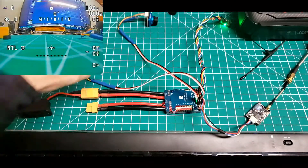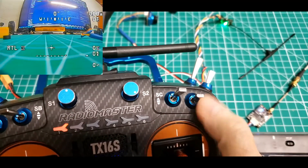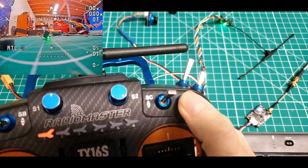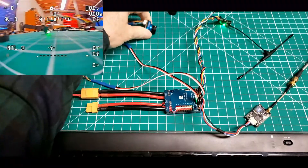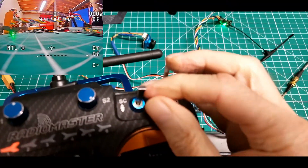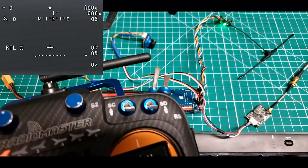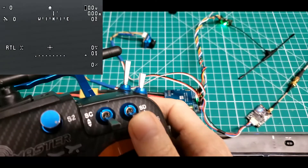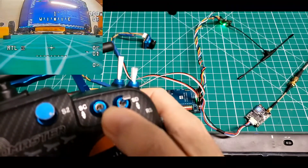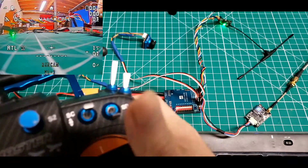Using RC10 and pulling it down to the third position — bang — we switch to camera two. Now while camera two is on screen, if we take RC9 and pull it all the way down, the power to VSW and camera two are disconnected. If we then switch back to camera one and later want camera two again, we don't want it off — there's an unwanted delay of switching to two and then turning two back on.